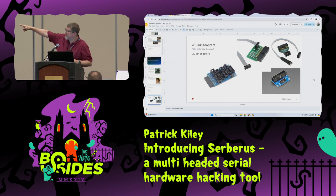The little snap-in connectors for programming devices, it's the same story. You need to be able to connect those up, and trying to have a whole bunch of DuPont wires scattered across that makes it a little more difficult, whereas if you just have a single thing that you can plug in and do your flash programming directly, I thought that might make it a little bit easier. And it has, as you'll see when I connect to this automotive target.